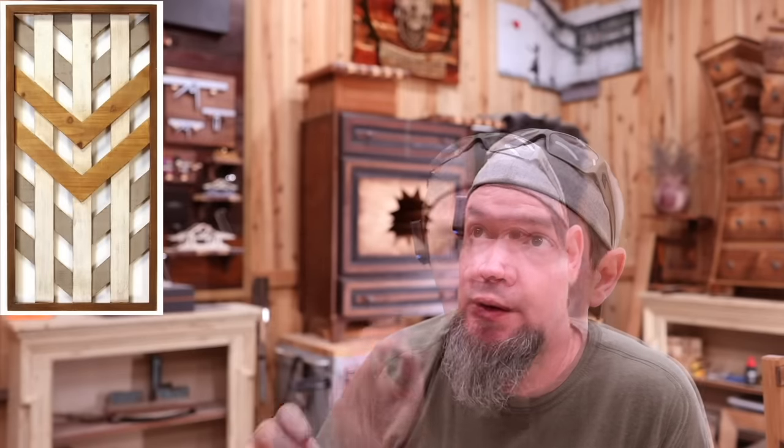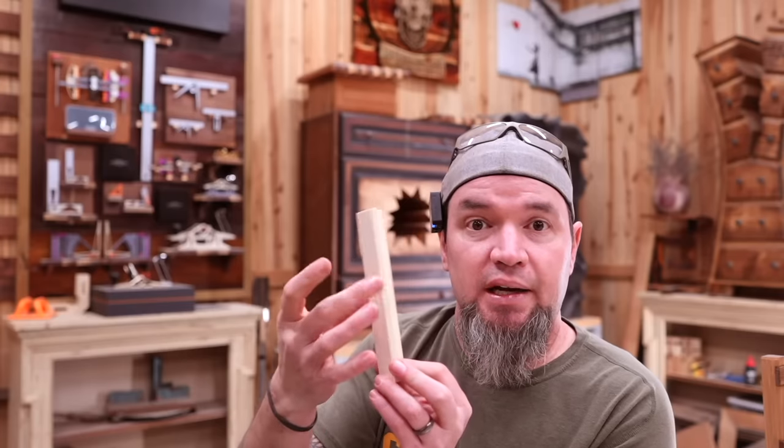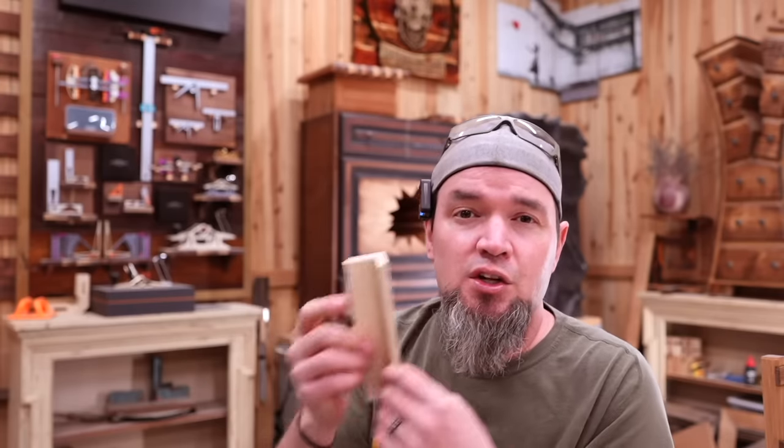For a $207 piece of wall art they're using thin plywood. This thing is 16 by 32 inches long and an inch and a half thick, so the boards are half an inch thick each and about two inches wide. Start with all your gray 45-degree arrows in the background — they're 16 inches wide, put the 45s on the opposite end to get that width. The next layer is the white boards, attached with wood glue and brad nails. The third layer is the brown arrows on top.